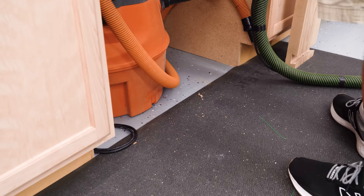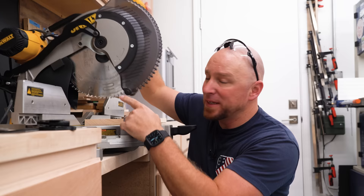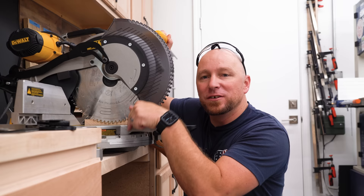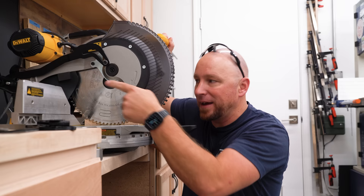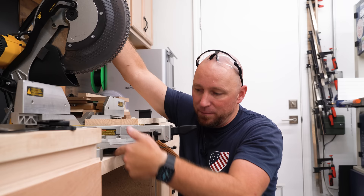What I notice is that every time I use the saw, I still end up with a pile of sawdust all over my feet. As the blade comes down, we have perfect dust collection through the cut until the bottom of the blade actually pierces through the bottom of the material. When that happens and it goes below the table surface, we're shoving that sawdust down under the table. There's no dust collection back there, so it collects down underneath and pours out the front.